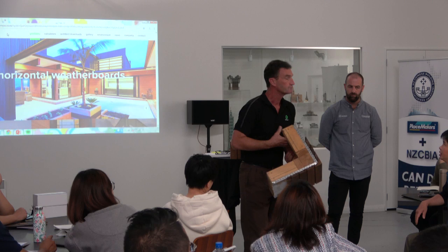I recently attended a brand seminar and they talked about the measurable heat on a weatherboard. On an 18 degree day, so the temperature was 18 degrees, the weatherboards on a white weatherboard house were 54 degrees. So that's how much heat is being held by the sun. That's on a white house. So you can imagine what it's like on a black house. It'll be too hot to touch. So all that is affecting the timber and it's wanting to move.